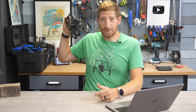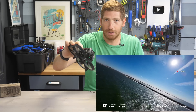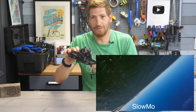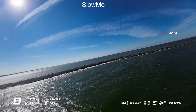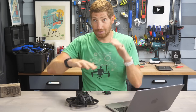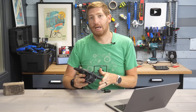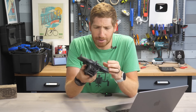Here's what I think actually happened. I'm in sport mode — in theory you shouldn't get flips — but the drone is flying with the wind coming over it towards the pier. I made a very small correction to bring it down and up the pier, and when I made that correction it basically just caused it to flip. Just that little bit of movement, a little too quick, caused the flip and pulled it over. You may wonder why it shuts off when you flip it on landing but not in the air. If you've flown DJI drones, you know that if it does flip with enough altitude it'll almost always right itself — the idea being that while it's still falling it says 'I'm still flying, maybe I can save this situation' — and it did exactly that.